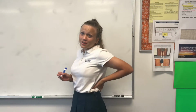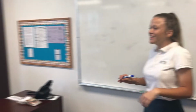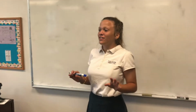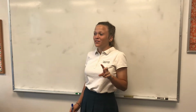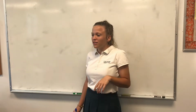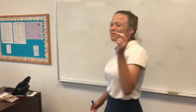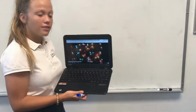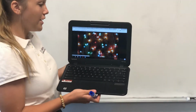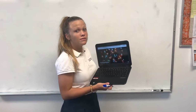So, in a parallel circuit, all components are connected across each other, forming exactly 2 sets of electrically common points. A branch in a parallel circuit is a path for electric current formed by one of the load components. An example of parallel circuits that I've found is Christmas lights. The reason why is because just because one light goes out doesn't mean the rest of them will.